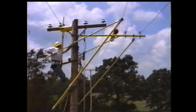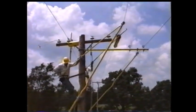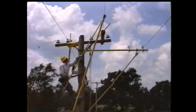Pull on the 1.5 by 10-foot wire tong until the conductor is above the insulator. Have ground personnel slowly come off the blocks and guide the conductor onto the insulator with the 1.5 wire tong. Then tie the conductor into the insulator.